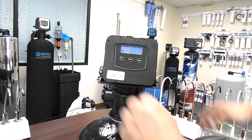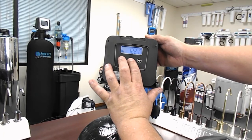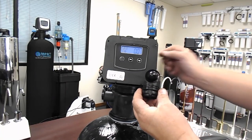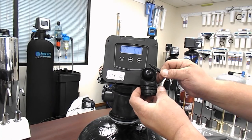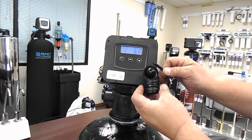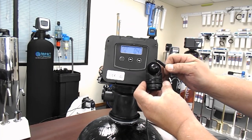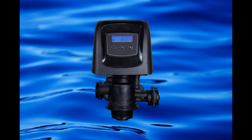A simple way to test the meter turbine and the meter cable is to remove the meter turbine and the meter cable from the back of the valve. Push and hold the regeneration and up button simultaneously to go into diagnostics mode — this will bring up FR, which is flow rate. Spin the meter turbine and hold it close to the flat edge of the meter cable; you should see the flow rate in the control panel reading gallons per minute. Thanks for watching Impact Water Products' tutorial on how to rebuild a 5810 and 5812 valve. Check back often for more tutorials and informational videos.